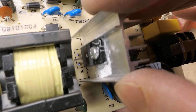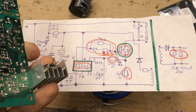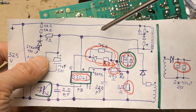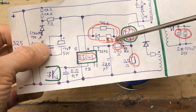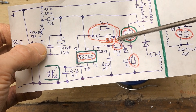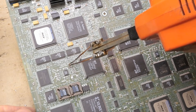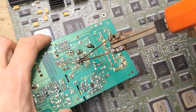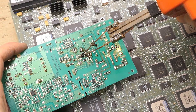It's probably just going to blow up again anyway. Now the transistor goes in. It might also be a better idea to replace the surrounding components before the transistor is in place. The 75-ohm gate charging resistor — not critical, I can put 68 ohms here. The gate discharging resistor is 8.2 ohms — not critical either; 10 ohms should be fine.